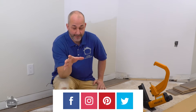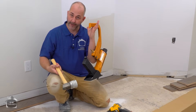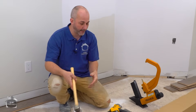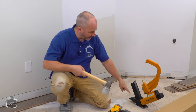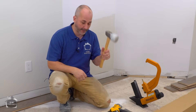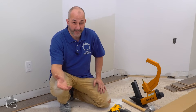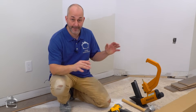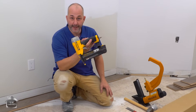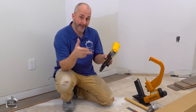You're going to need a couple of tools. One of them is a floor nailer — basically a hardwood nailing machine. This particular material isn't quite three-quarters inch, which is standard for hardwood, but it fluctuates between five-eighths and three-quarter installs, so it works for any situation. It comes with the hammer and you can rent it at your local hardware store — Home Depot charges about $30 for the whole day. The other thing you'll need is a brad nailer — this one shoots an 18-gauge 2-inch brad.